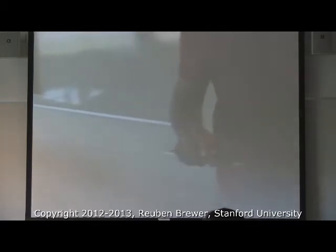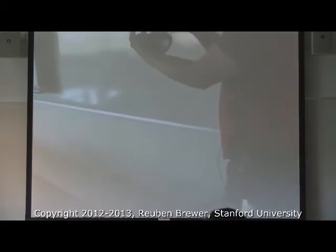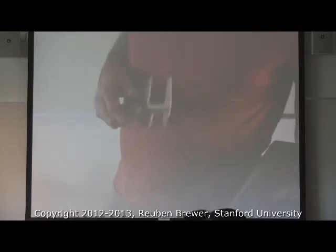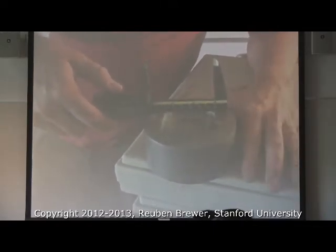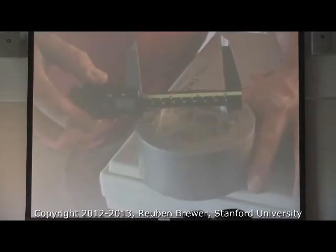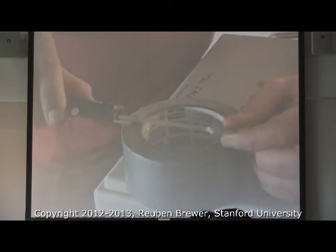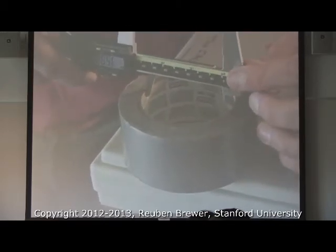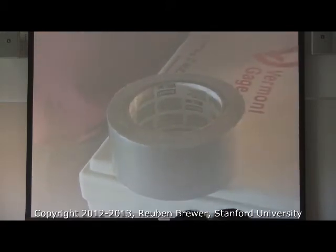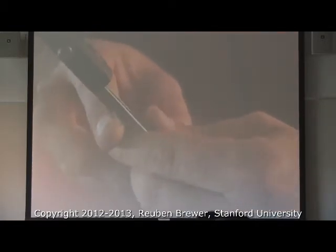So that's the outside. Now these two jaws are the outside jaws. Let's talk about the inside jaws — what do you think that's good for measuring? Inside. This is my demo — a giant wad of tape. I just wanted to show you the type of measurement you could take. You can't line up the outside jaws like this — that's not accurate. The way you want to measure the internal diameter is something like this using the inside jaws. But the inside jaws are only sharp — there's no fat piece like on the outside. So measuring the internal diameter of a hole with calipers is not a precise measurement.